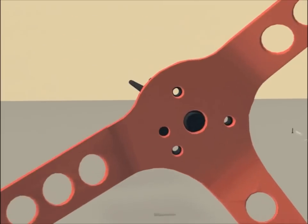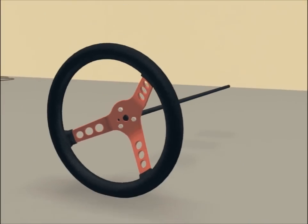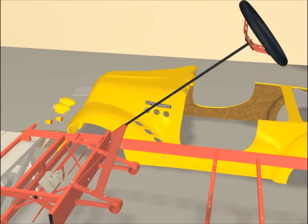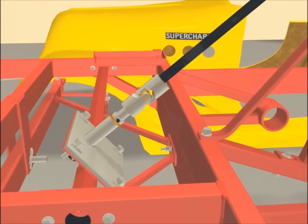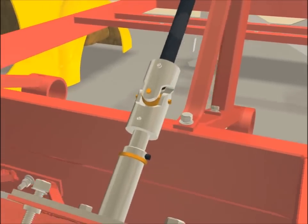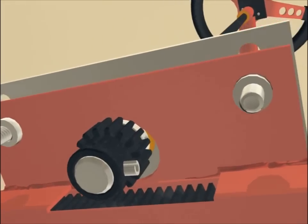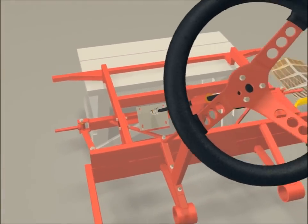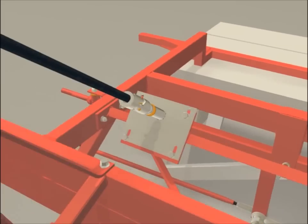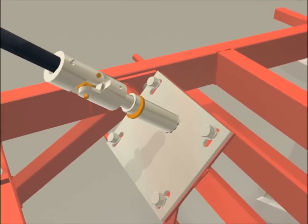Now your steering wheel is assembled to the steering shaft using three bolts. This is brought to the frame and placed through the steering column into the universal joint. Another expansion pin is put in at this time. Pick up the plate with the gear to straighten the steering wheel out. Place the gear into the rack and pinion so that it lines up, then tighten up the bolts.